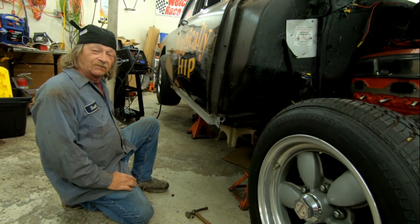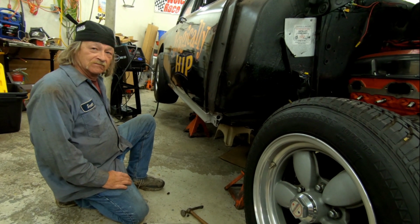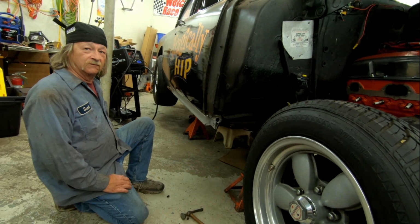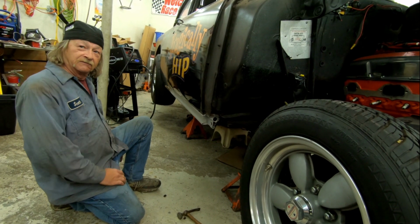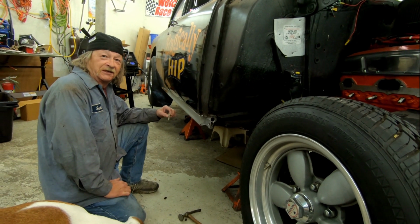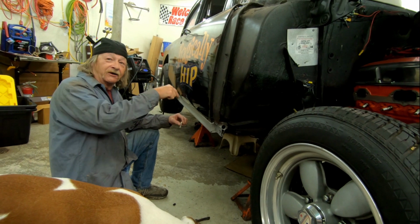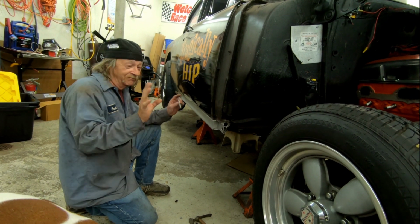It had that one spot where you made that piece that comes down. Do we want to weld that to the rocker? Which one? The back of the jamb, where it comes down into the bottom of the jamb. You put that plate in, and then where it stepped in there, where you can see the edge of it? Yeah, like right in there. It's all welded. Oh, that is welded? Yeah. Oh, I thought it was just laying in there. I drilled holes in the piece I made. Oh, and then what'd you do? I welded across the top solid, and then I drilled holes in there, and then I made it fit the radius. I welded it to the rocker, and then I ground all that, so it looks like it's one piece. Oh, okay. So now with a little bit of Bondo on it, you'd never even notice it was ever changed.